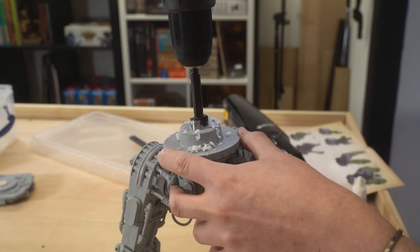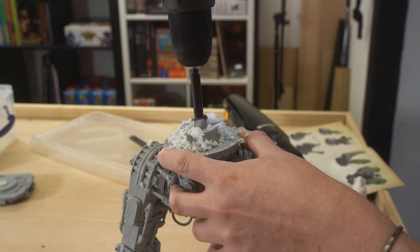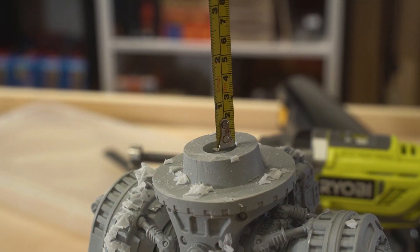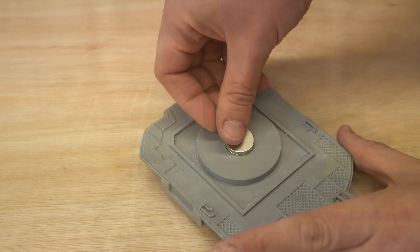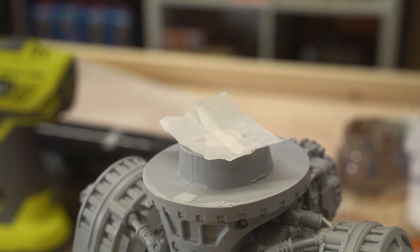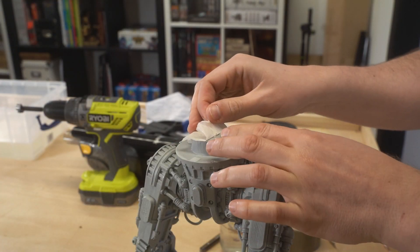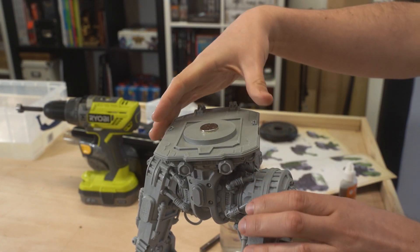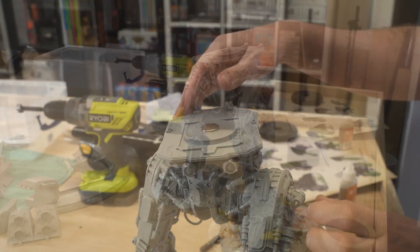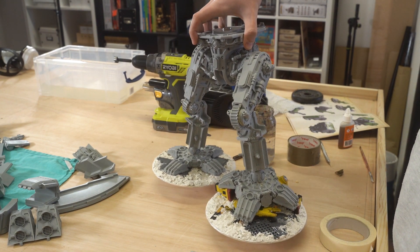I'll just need to use this Forstner drill bit to drill out a little groove for them to sit in — not all the way through though. On the waist joint at the top of the legs, I do the same: marking out the centre with my knife and then carefully drilling down so there's a quarter inch deep hole, enough to fit the two magnets. I was hardly putting any pressure on the legs here, just letting the weight of the drill do its thing really and taking my time. After checking I got the polarities on the magnets right, I added a bit of Gorilla glue to both sections to hold them in place, and then clamped them while the glue dried and expanded. To stop it sticking to the clamps, I also stuck a bit of masking tape to the top of the magnet. After a few hours — tape off — and boom. Nice and solid, and it still turns.